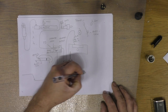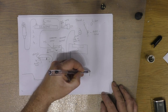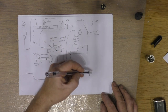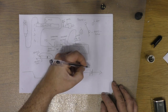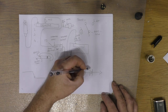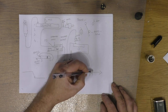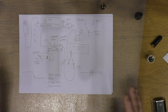If any RF is picked up on any of these cables, the DI box is not going to let that RF pass and get into the radio. In layman's terms: you have a connection, then the transformer, then it goes on to the radio. The audio signal passes through the transformer by induction, but any RF on the signal is not going to make its way into the radio and distort your audio.